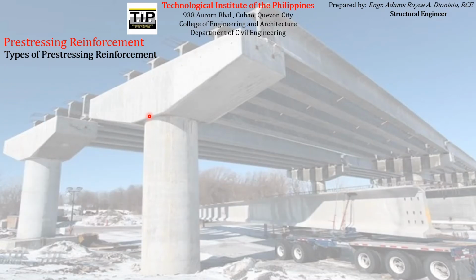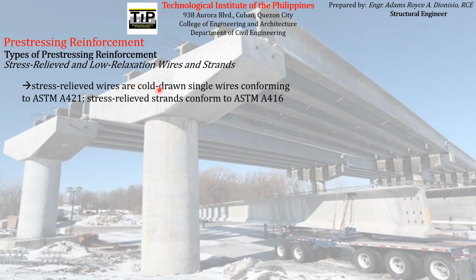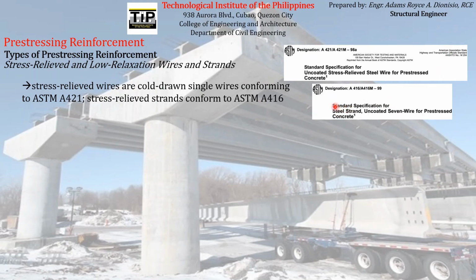So now let's go to the first two, the stress relief and low relaxation wires and strands. So what are those? Stress relief wires are cold drawn single wires conforming to ASTM A421, and the stress relief strands conform to ASTM A416. So for the wires, the ASTM specification must be ASTM A421, Standard Specification for Uncoated Stress Relief Steel Wire for Pre-stressed Concrete. And then for strands, we usually refer to ASTM A416, the Standard Specification for Steel Strand, Uncoated 7-Wire for Pre-stressed Concrete.